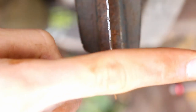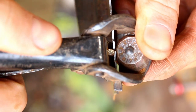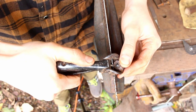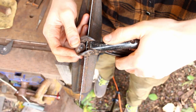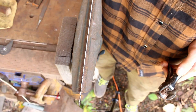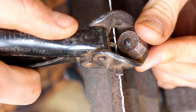We'll see how this tooth is pushed going that way, and this one is pushed this way, and then that one is pushed that way too. We're going to squeeze it, move on to the next one — make sure you lift it up. Lift it up again, move on to the next one. Make sure it's actually setting the saw. It feels like it is. I'll bring you a little bit closer so you guys can see. Watch how it pushes the saw tooth away — it'll do the same on this one. Pushes it away.